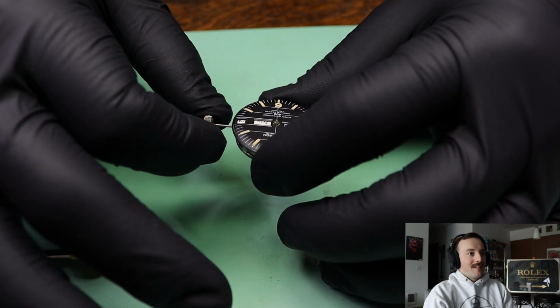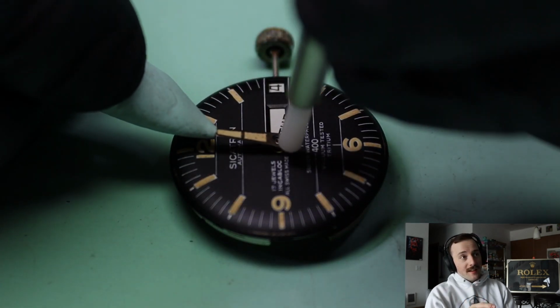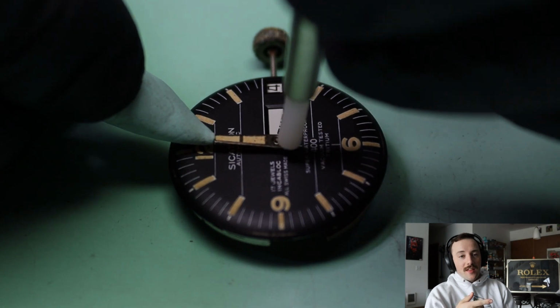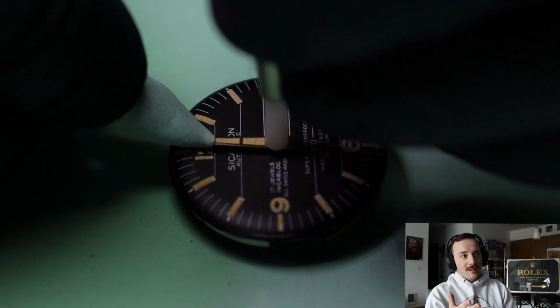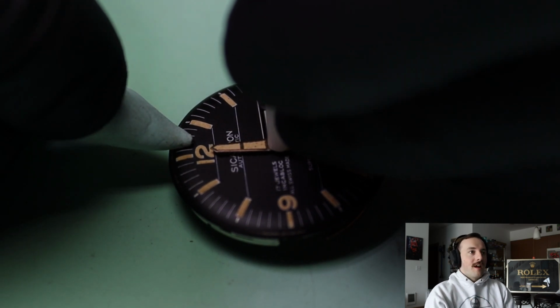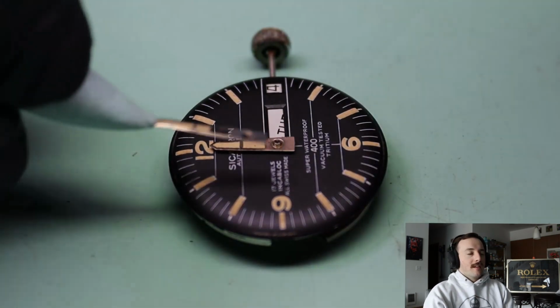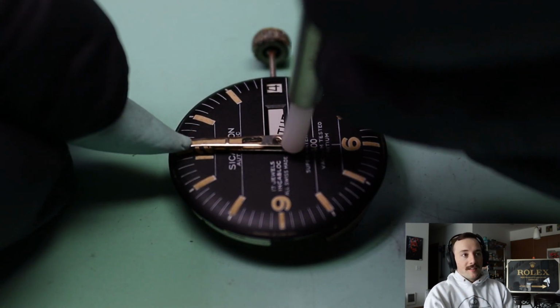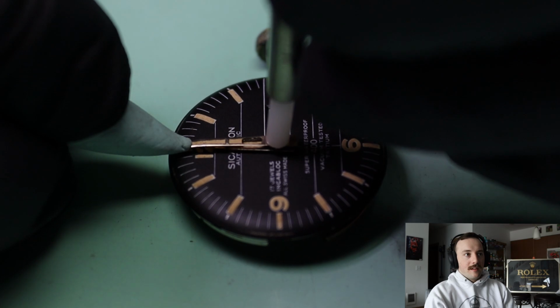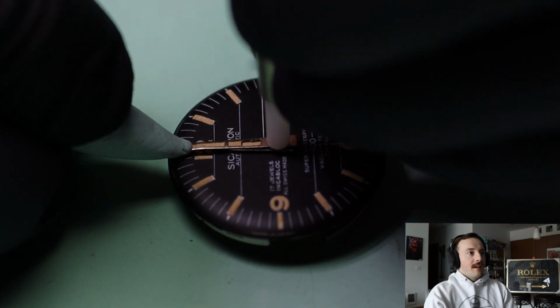See the date? And so, since that is the case, I'll install the hands on date change, and then the day can change in 5 minutes or 10 minutes or whatever the difference is. But I always put the hands on when the date clicks over as opposed to the day, because it would already be the next day indicating. So, date then day.